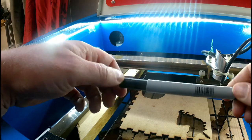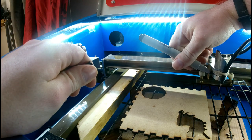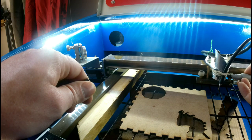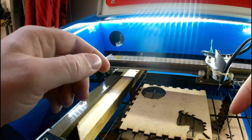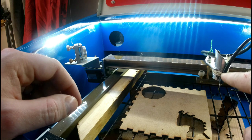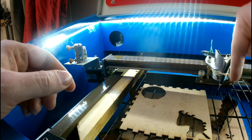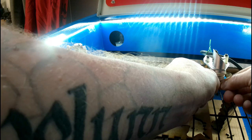So the next thing — get a marker pen and on this head mark your alignment in a couple of places. I've been meaning to do this the past few times I've cleaned this head, because when I line it back up sometimes you get a dot and then a crescent moon around it. With this stock head you can't adjust where the mirror is aligned, so whether it's pointed straight down vertical or not. As soon as I can I will be upgrading that head. I'll just use an elastic band to tie my air assist on there as well.